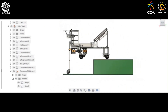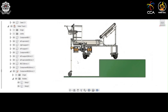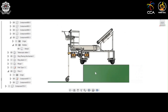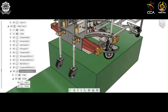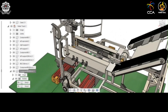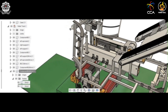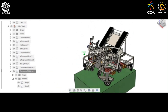The omni wheels at the front of the chassis start moving, pulling the entire chassis forward until the caster wheels hit the wall of the race platform. The chassis body has now moved forward until the race platform hits the caster wheels. The caster wheels are then retracted back to their original position, and the linear actuator driven by the back mechanism pulls it back. In this way, the entire chassis climbs up the race platform.